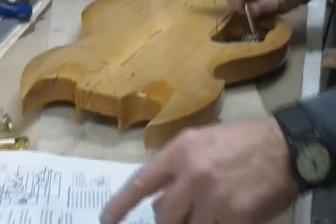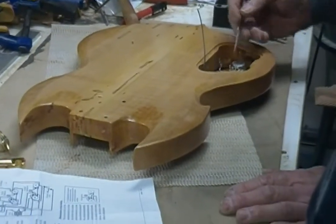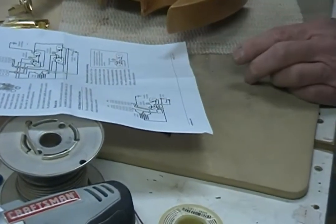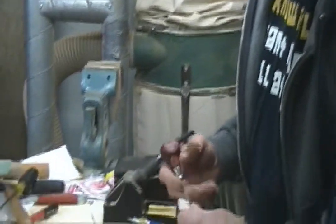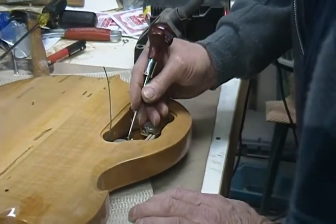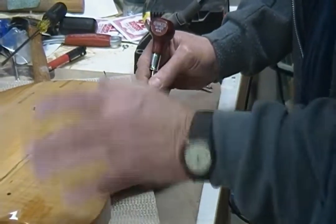You can see here it goes out to the volume right here in the middle and over to the first lug. The first lug of the volume connects to the first lug of the tone. And these connect the capacitor. Some drawings just have the capacitor going from the center lug to ground. All they've done is take the capacitor from here over to the ground. This lug bent all the way back to the case and soldered because this has to ground to the case. This one over here never gets connected to anything in a normal setup.